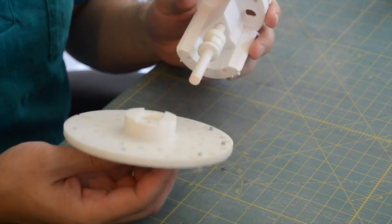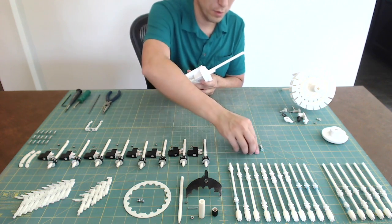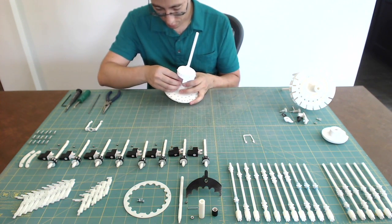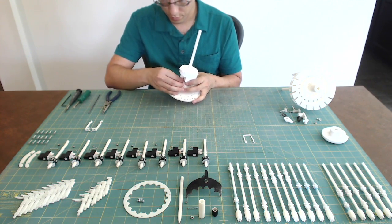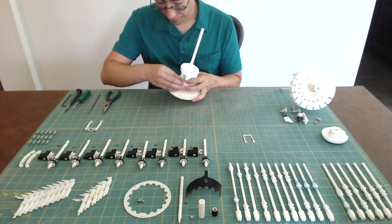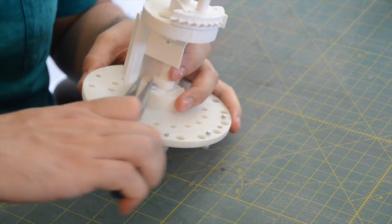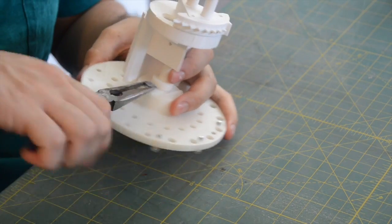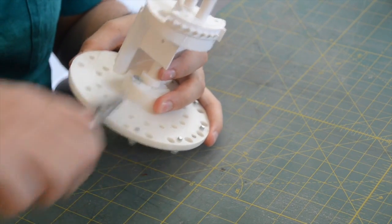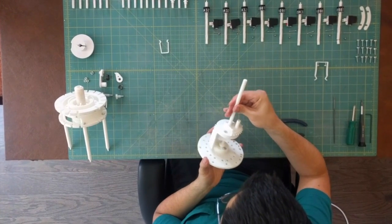The step drum assembly is inserted into the bearing plate. A small anti-rotation plate is fastened with an M5 screw to prevent rotation in any position except the correct ones for addition and subtraction. Tighten securely, but do not over-tighten. The step drum should rotate freely without much friction. Lubricate with PTFE dry lubricant before assembly.